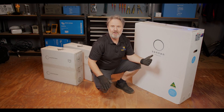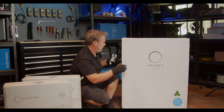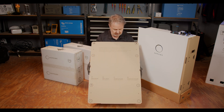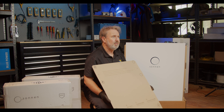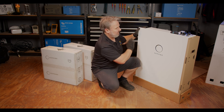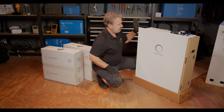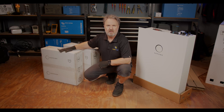This big box is the main event — the inverter and the cabinet. The instructions show to remove these blanks, which stop the cover coming off. We have a lovely mounting template here — no doubt for positioning it precisely on a wall and drilling holes or finding studs. I love it when they provide templates. And for expandability depending on how tall we want this to be. This is our Sonnen battery 9.53 — very simple, beautiful exterior, powder coated steel, feels very solid, with ventilation on the side and connection points above for solar and DC. Let's have a look at the battery modules.